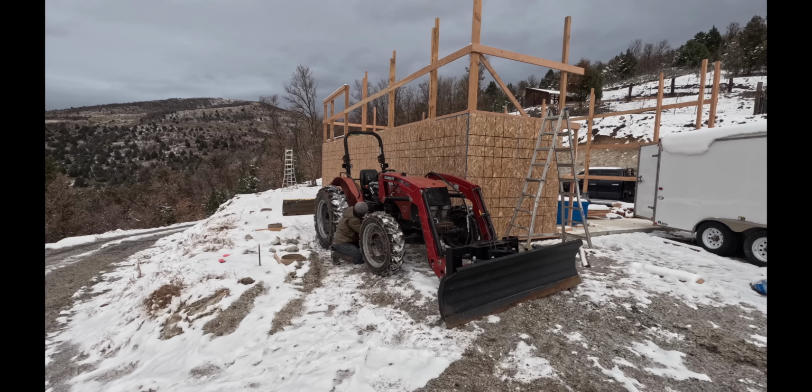This angle brace had to go in a little bit differently than the others. It needed to go up high enough to clear the main entry door that goes into this section of the wall. With all of that in, and the door framed in, now we can install the sheeting on the front of the wall to secure this end of the big wall.